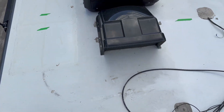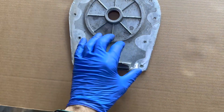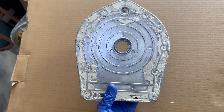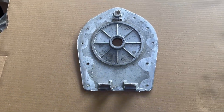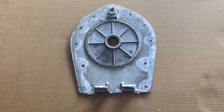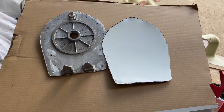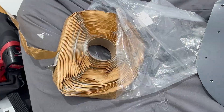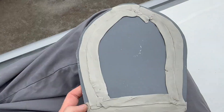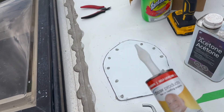So we are at day number two — I was rushed by rain yesterday. I will use the old Batwing antenna base to make myself a template for a piece of flashing aluminum that I will install to cover the hole. So I drilled some holes, made sure they all fit, and I will apply butyl tape.